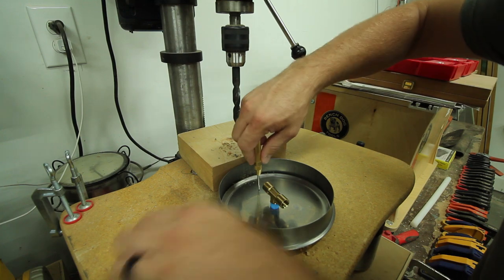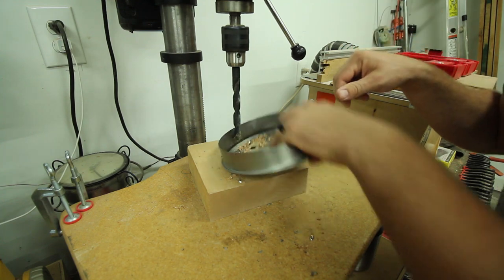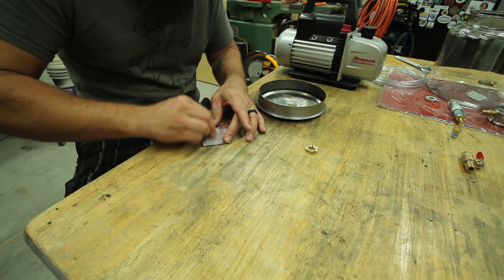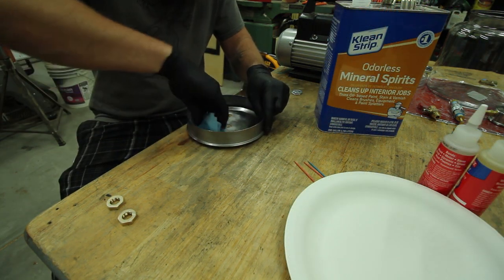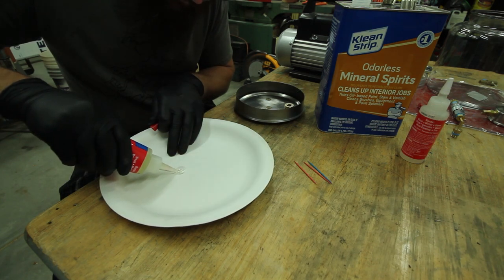There will be a link in the description to a detailed article with a shopping list. You'll need to drill a couple holes in the lid for the gauge and inlet, making sure to leave enough room around the edges for a seal. If your lid isn't concave like mine, you might be able to use one large seal for everything. Otherwise, epoxy will work out nicely for the gauge and inlet. You'll want to roughen up all of the surfaces with sandpaper and then clean them with a solvent to help everything bond together.